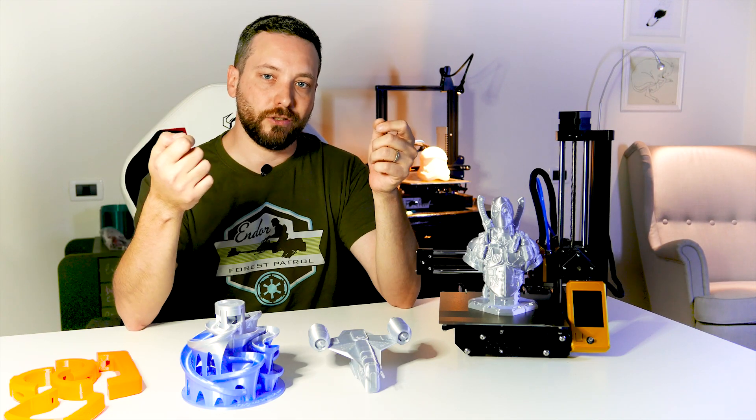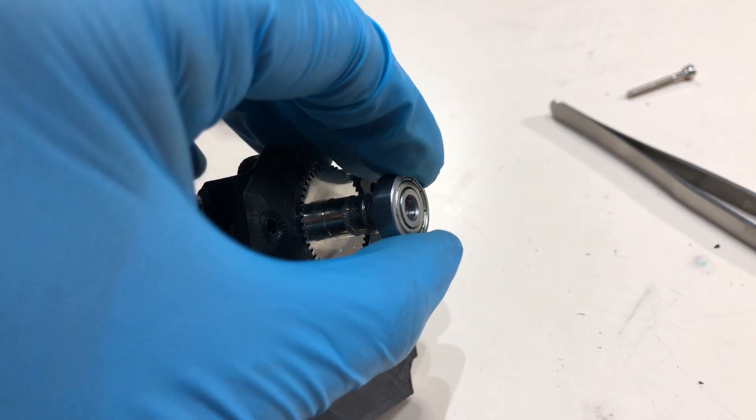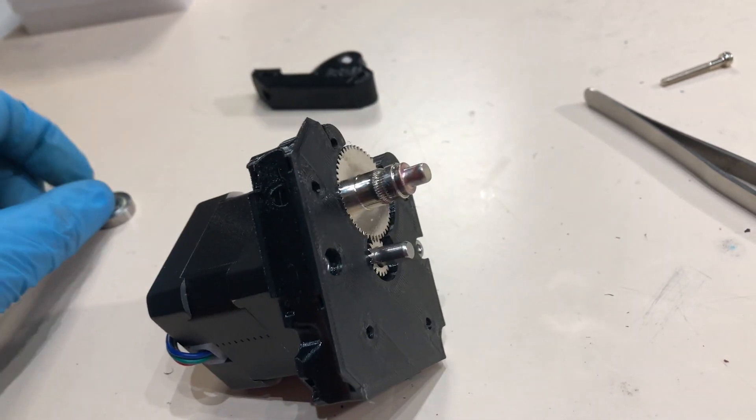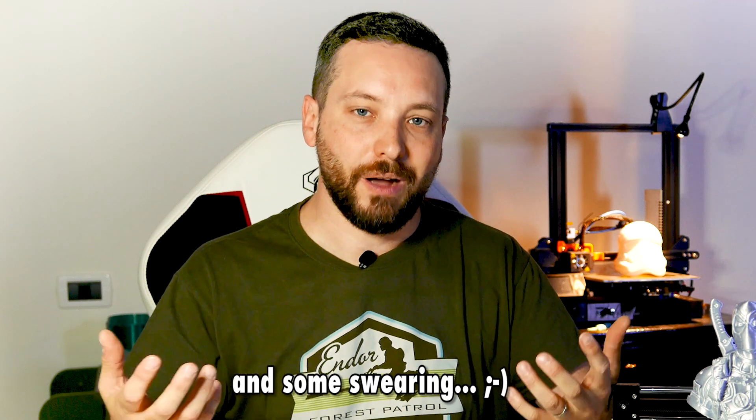So I had to polish it a bit and remove the coating to make sure it would fit into the bearings. I actually made a mistake press-fitting one of them by hammering it, which I think was a mistake because if I have to take it out, it's going to be painful. With the second one, I had to grind it off and make sure it was sliding freely. Because if you get your filament stuck in the extruder and want to tear it apart, you have to take the bearing off the gear. That required some time, patience, and repairing skills, plus access to tools and an understanding of how to deal with mechanical parts.